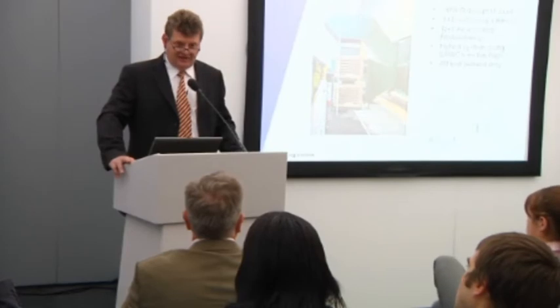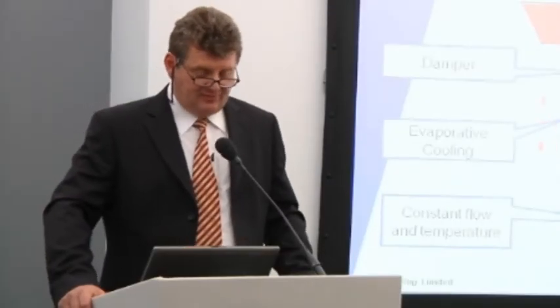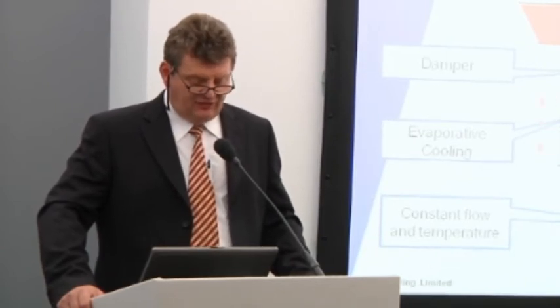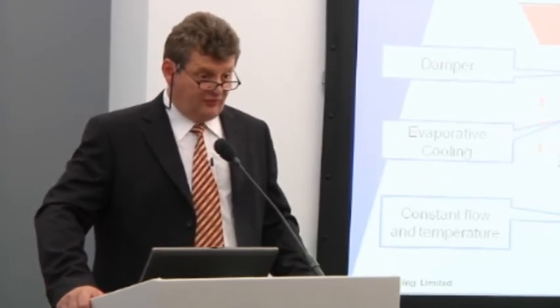This cross-section gives a simplistic view of how it all works. We have an evaporative cooler providing air through an axial fan, down-discharge and into a raised floor. Air goes through the grille on every conventional raised access floor, into the cold side of the racks where it's pulled in by the fans. It then comes out through the hot side and is exhausted out of the building.